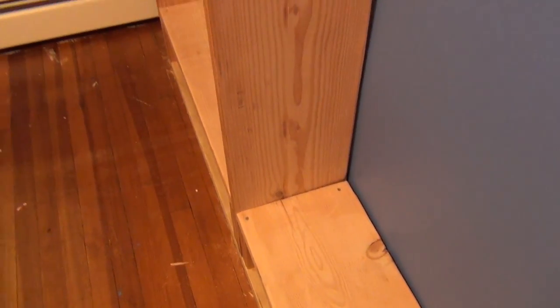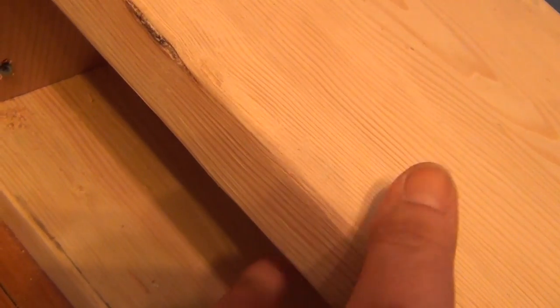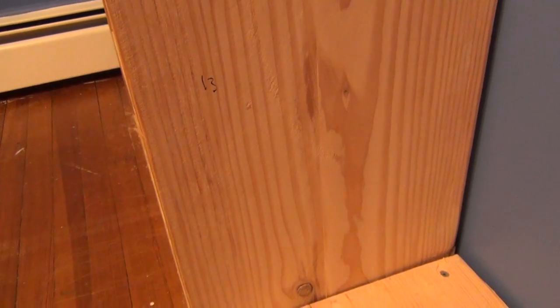And I've already measured where I want my shelf, so that's what I'm going to do in the next video. Every shelf is going to be the same thickness as this wood right here, which is 1.5. All right, they call them 2x10x12 or 2x8x10, whichever, but they sell it to you as being a 2, but it's not a true 2, it's actually 1.5. So I want most of the shelves to be 13 inches tall. The reason for that is that we have art books, memorabilia, things like this that are tall, and I don't want to have to put them flat.